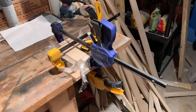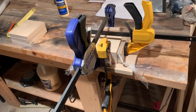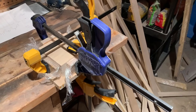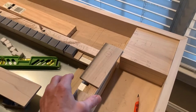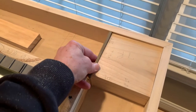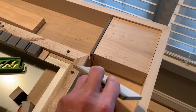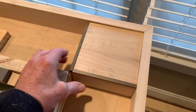I took three pieces of three-quarter inch poplar, cut them square-ish, and then glued them up. This will be the block that the cup holder is going to sit in — later I will cut a large hole so that the actual insert will fit. Then I took some finished pieces of wood, maybe quarter-inch thick poplar, and cut them so they fit in there perfectly. Later I glue them up.